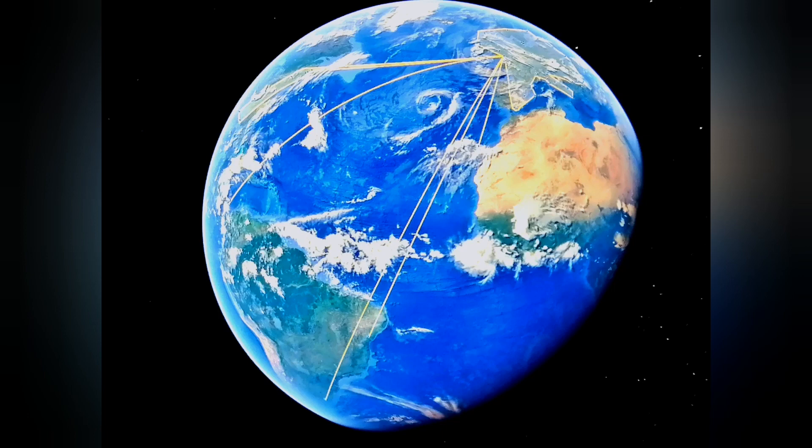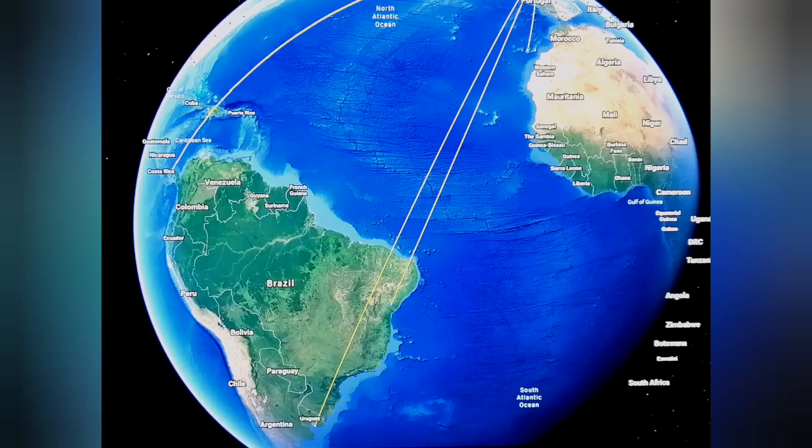The final map demonstrates the distances achieved by a mobile quarter wave whip — either an Ampro or full-size quarter wave whip on 20 meters — from the seafront going all the way across saltwater. Those signals are going out to central America and south America. This view shows contacts going south to the Canary Islands, across to Panama, Brazil, and Uruguay. Zooming in, you can see these contacts went right across the Atlantic and into Uruguay. The distance from Heel Head down to Uruguay is around 7,000 miles.